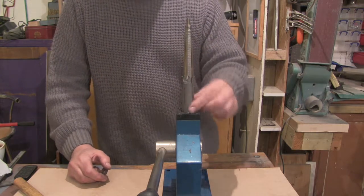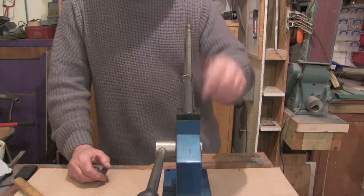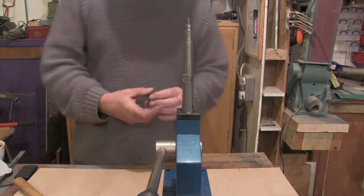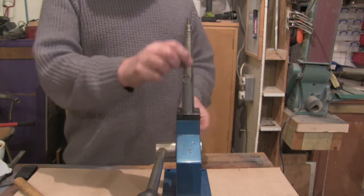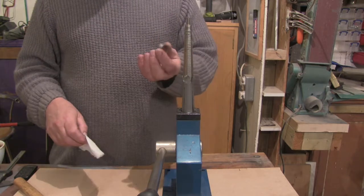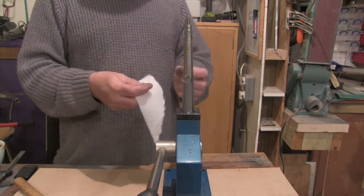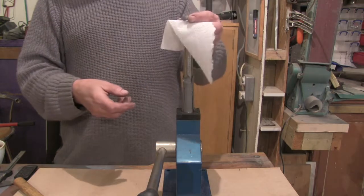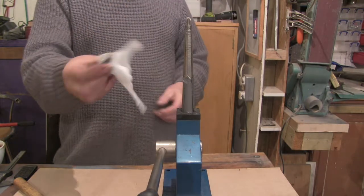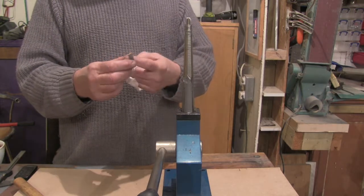You can see that mine's getting in a bit of a state, but I used to put electrical tape up this and then just put a craft knife up the splines just to split it, so that it protects the ring a bit. This one does have ring sizes on it but I don't need to see them - I've got a mandrel that I use for sizing. You can wrap your coin in PTFE tape but I find that a little bit fiddly. If I'm particularly fussy about protecting the inside of the coin I just put it through a bit of tissue.